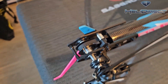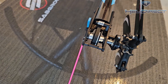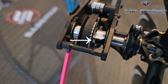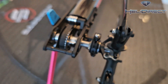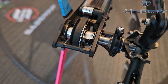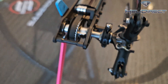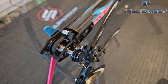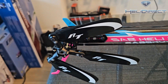This is also true in the tail. One screw that seems to always come loose for me is this screw here. I'm very diligent about making sure this screw does not back out after the first couple of flights, and I keep checking it probably every 20 or 30 flights to ensure it hasn't backed out. All of these critical components — all the spinning components — I will take a screwdriver to ensure that everything is still tight.